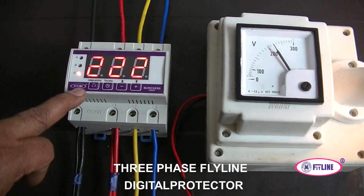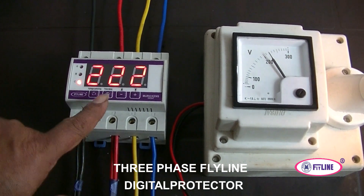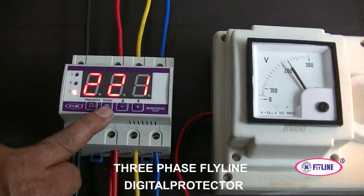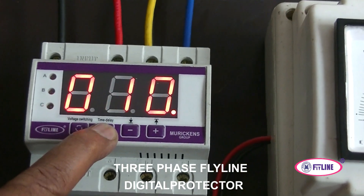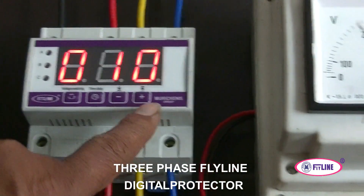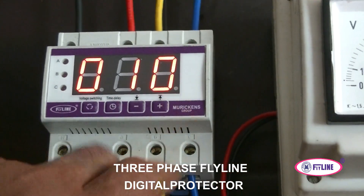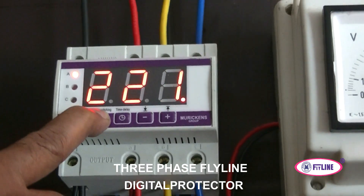The second DIP switch is a time delay button. When you press it, you can see the time delay set in that unit — currently 10 seconds. If you keep pressing that DIP switch for 10 seconds, the digital decimal point will start to blink, and you can then increase or decrease the time delay set point.